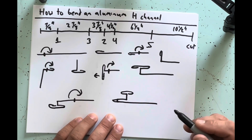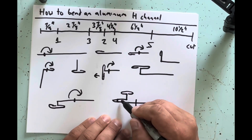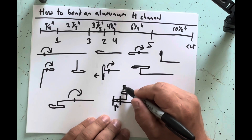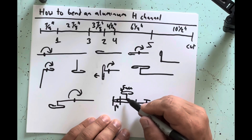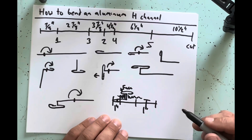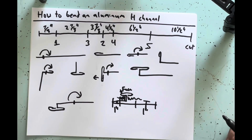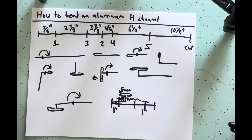The finished piece — not to exact proportions — should have about an inch to nail to on each side, with the face in the center and a half inch pocket inside to accept your siding or soffit. Hopefully that clears things up. Watch the video and if you have any questions feel free to comment — I'm still replying to pretty much all comments and I'm here to help.